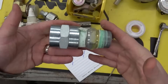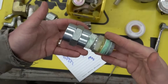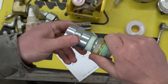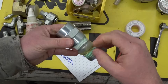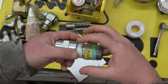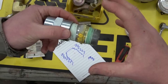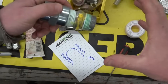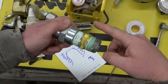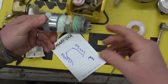I'm going to answer a mystery of the universe: why these NPT threads always invariably leak. It is because of constrained expansion. When you tighten this up and it gets constrained on the threads, as it heat cycles — say it warms up — it's constrained on the threads so it can't grow there. It grows everywhere else but not on the threads. However, when it cools off, it's not constrained on the threads, so it shrinks down and you start to open up that spiral leakage path. Pipe thread — horrible — but it's a legacy, we're stuck with it.